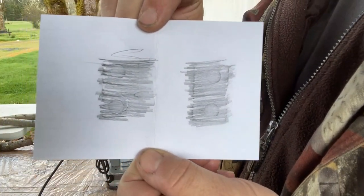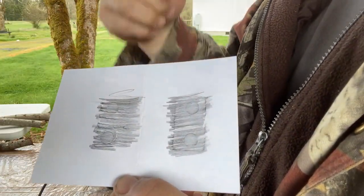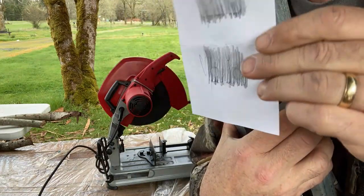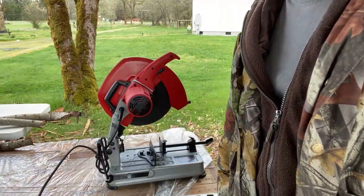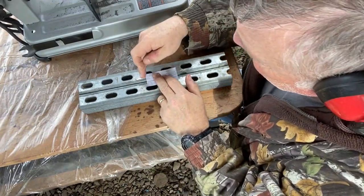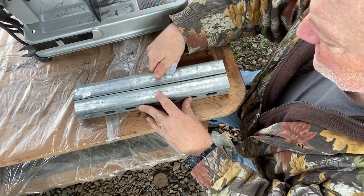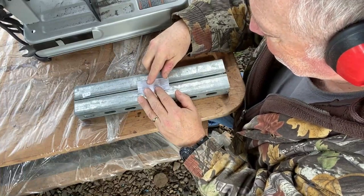I made a little scratch template out of the bottom of the hydraulic unit — you can just see the four bolt holes here. I just have to line this up with this, weld these together, and I think this will be a good, sturdy bracket. It looks like these holes are just too far apart, so I'm going to have to drill that out anyway. Instead of having this being weak, I think I'm going to just weld these together and drill the holes out. I think that will work beautifully.